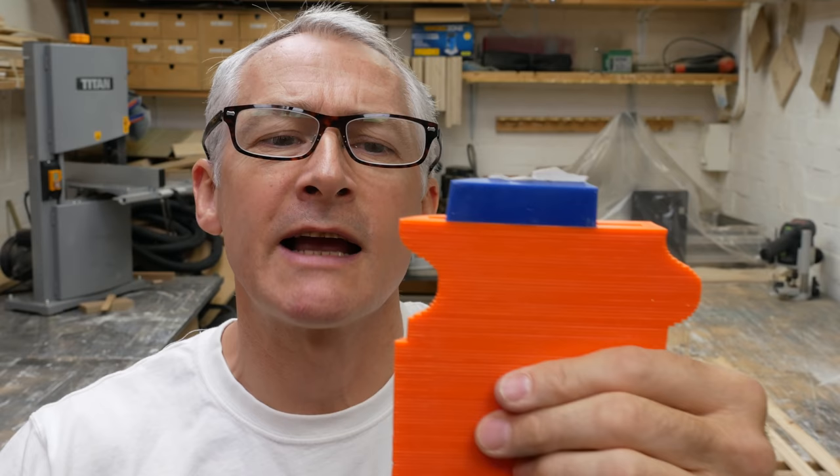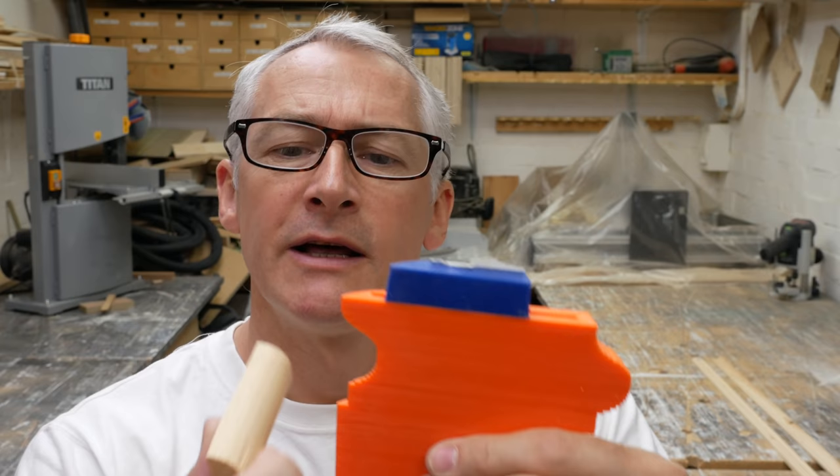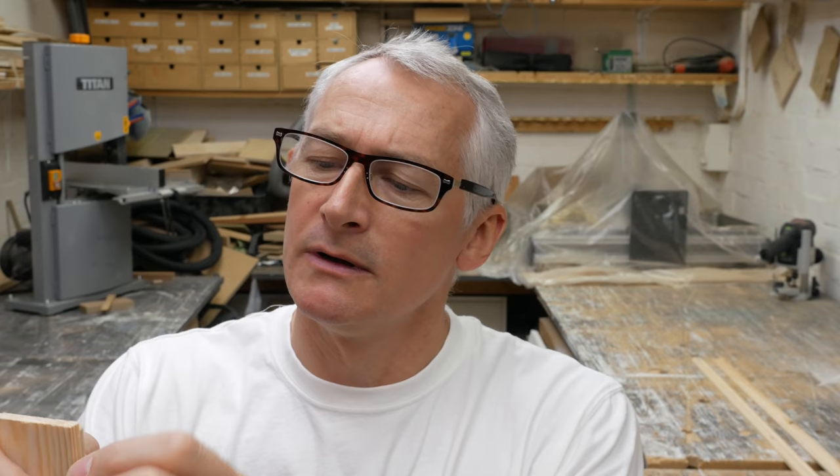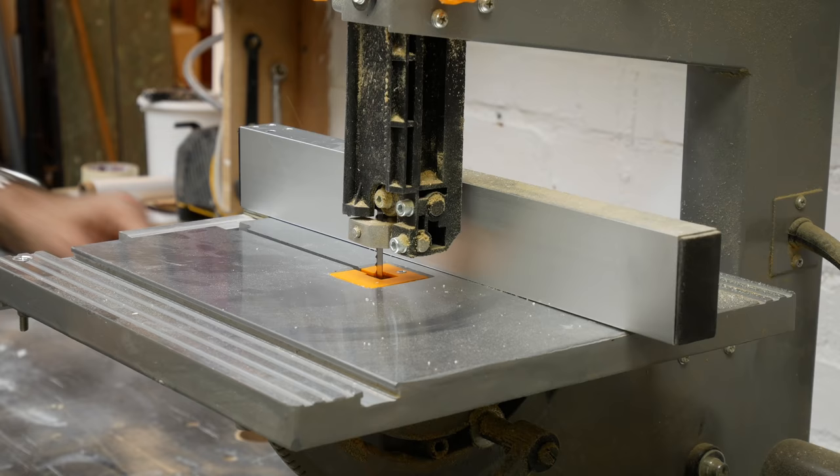The other little bit of moulding that I've got to do is up at sort of picture-rail height. I don't have a piece of that — I can only take a profile off the moulding that was already there. It's a bit of an awkward one. It's almost exactly the same depth as a piece of 25 mil dowel. I couldn't get any half 25 mil dowel for some reason — I could get 22 or 18 — so I'll have to rip that down on the bandsaw. Once I've done that, that'll fit in there pretty well. Then I'll mount that onto a piece of strip wood and just cut it down to length, cut it down to width, just to get the right sort of shape. The whole thing is going to be quite heavily filled, and of course it'll be way up above head height, so you're not going to see that much detail there. As long as I get the overall dimensions right, it should go back in without too many problems.